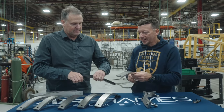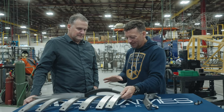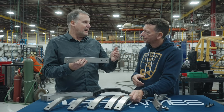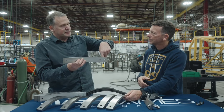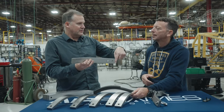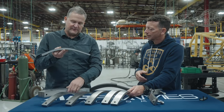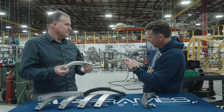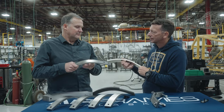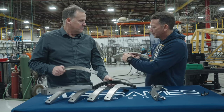These look perfect. I'm used to tail springs being sort of all over the place. Wire EDM is kind of like a hot knife and foam — it just blows through the material. It's electrical discharge machining. It goes pretty slow but it's extremely accurate, so our arch is perfect and it's perfect spring to spring. I noticed it's thicker up here and thinner down here — that's to get the right spring rate. The old steel spring is basically trying to achieve the same thing in a much cruder fashion.